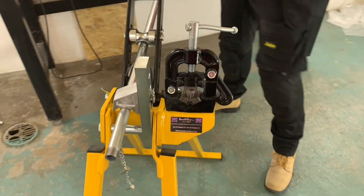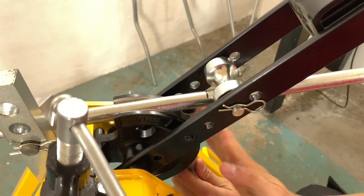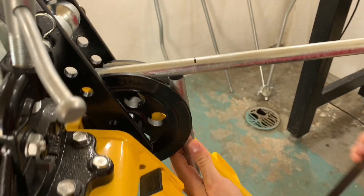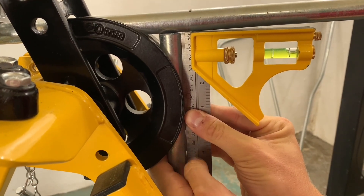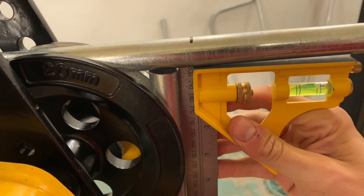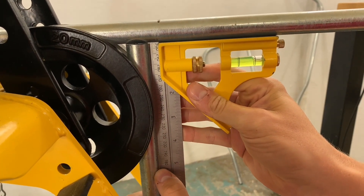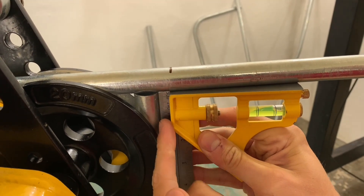The next stage: I'm going to take a piece of scrap conduit and insert that into the former, making sure my mark lines up with the back end. I'm going to use a set square. That scrap piece of conduit represents where the conduit would sit when bent into position within the former. I'm trying to get that mark on the back of the conduit. At the minute it needs to go in further, so I'll make sure this scrap piece is 90 degrees with the conduit we're going to bend, and then make sure the mark is in line.